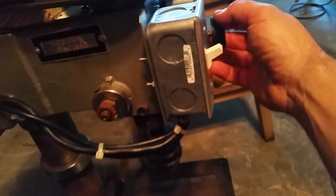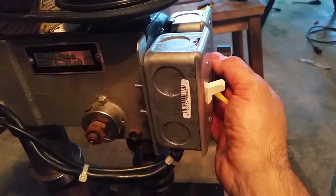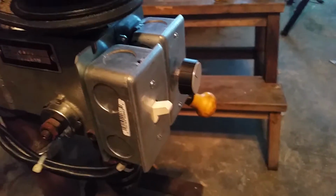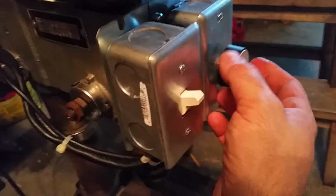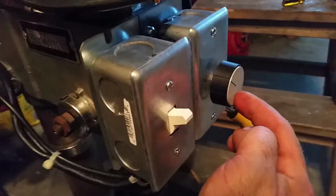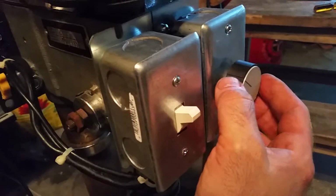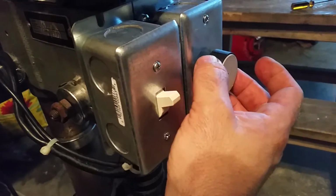First step, AC power. Now the nice thing about the dead man switch on the DC is this speed control has what they call a soft start feature. That's to prevent your treadmill from starting out at maximum speed. I haven't disabled that feature, but with an on-off switch in the center line of the potentiometer, it allows me to turn it on and off and keep it in the same position. So